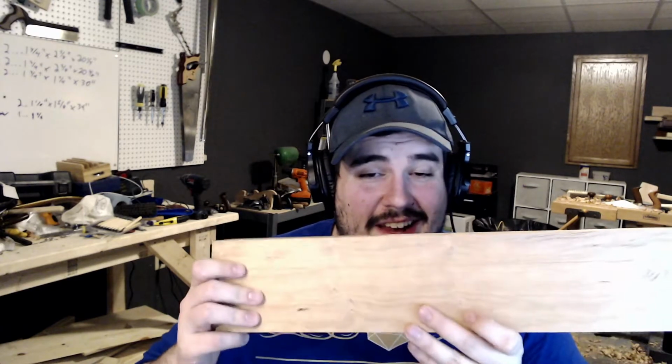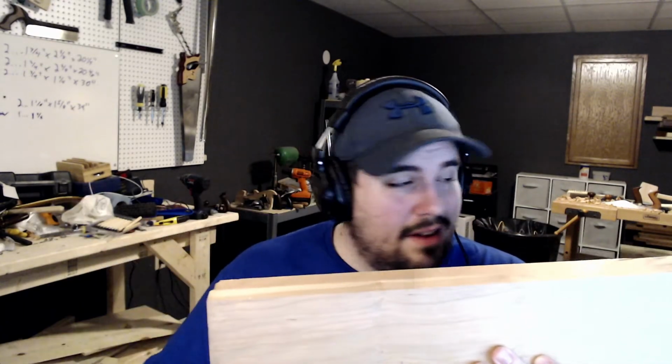Now there are some options. One is you can put this up and then try and saw it down, and I get very nervous that I'm just going to have incorrectable saw drift and it gets all crazy. Another option is you can sit here and take a hand plane and go at this over and over again. That's also pretty miserable. What I ended up doing was I just made a bunch of cuts vertically down to my marking line, every 2 inches or so,